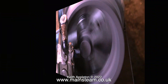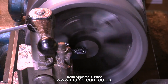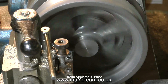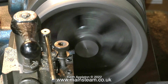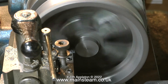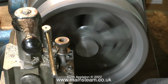That's as far as I can cut because the jaws are in the way, so it's time to turn the flywheel round in the chuck and machine the other side. The process is identical — facing across the front of the boss, then changing the tool to go down the side of the boss, being very careful not to go too far and hit the spoked area. To get through the surface skin I had to take slightly more metal off this side, so I'll need to match that on the other boss.